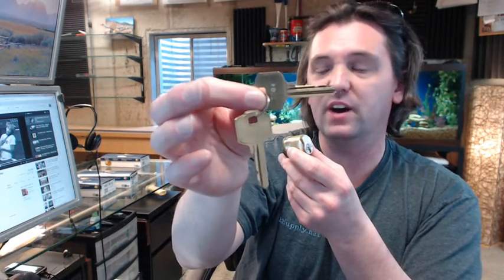The 5-pin key drilled 6 in the cylinder — there would be 6 chambers, but it is a 5-pin key blank, pinned 5. It is very high quality construction: solid brass cylinder housing, solid brass cylinder plug, which allows for very high machining tolerances, meaning that when it is properly keyed or when it comes from the factory it is very smooth in operation.